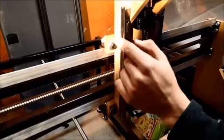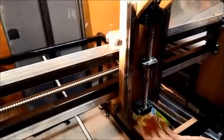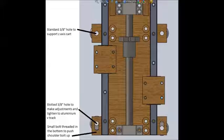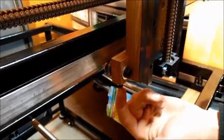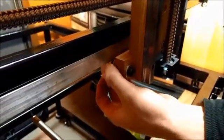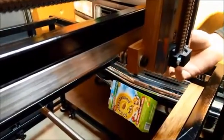These holes are stationary — this shoulder bolt is going directly through a 3/8 hole. Because gravity is working down, this is holding most of the weight. And then down here, there's a slot in there — I can show a picture of that. What I've done is come under here with a small bolt and push that up into that slot. And that is actually creating tension on the bottom of this V-groove bearing. So when I just spin that with my finger, it's connected. It's perfect.